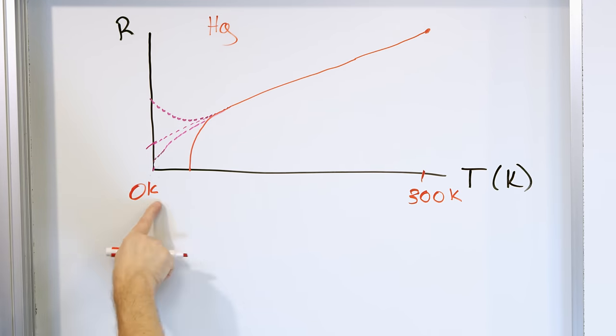Now, why do we have different pads here? Well, if I take a regular voltmeter, like from the hardware store, and just connect it, what the voltmeter is doing is sending current through, and measuring the voltage from the same probe tips. The problem is, if you touch a superconductor with the same probe tips, if you don't separate them like this, there's a contact resistance from where the probe tip touches the superconductor. So if you measure the voltage at the same place the probe tips are touching, you're going to measure the contact resistance. Since the superconductor gets all the way to zero, you don't want to measure any other resistance anywhere other than the superconductor. So you have to separate the current going in and the measurement of the voltage.